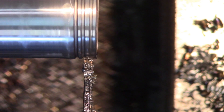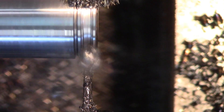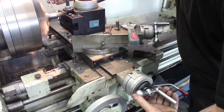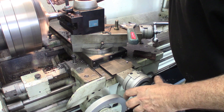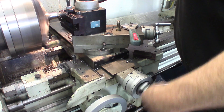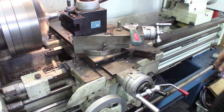Let's try it again. Lubricating the cut will help on the sides to lubricate the chips coming out of the slot. We're going to be moving faster — back off a little bit and restart. There we go, we're almost to the middle of it. It's going to fall in, and this time the adjustment was much better to center. This insert does, to my appreciation, a very good job also.